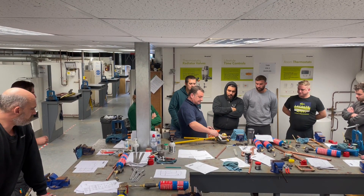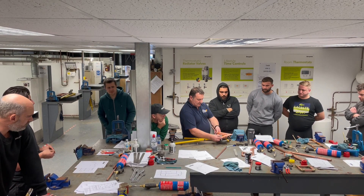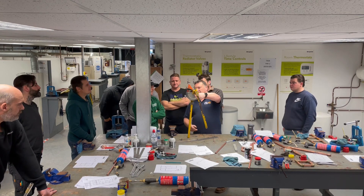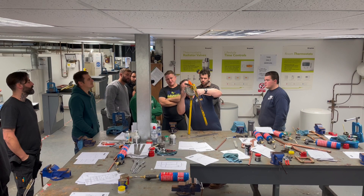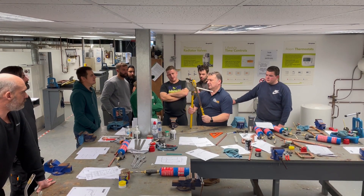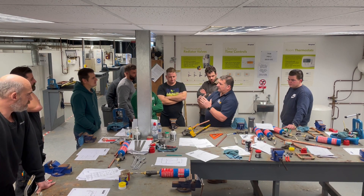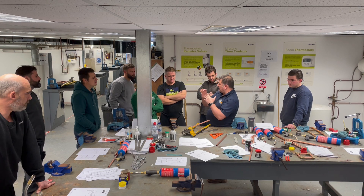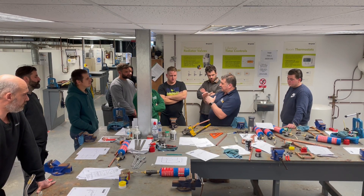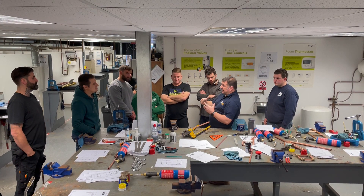How I do this — see the back edge of this? That back edge and that side will be square when I pull it round enough. So I line up. I'm looking for this pipe to be going up exactly with that. It's not quite there — it's away. Not quite there, so in that case it's another little squeeze. Personally, I prefer to go over a degree or so from the 90 — not too little, but just a touch — so I can squeeze it back out a bit, because what it does is it opens up your throat, which allows the gas to go through much smoother.